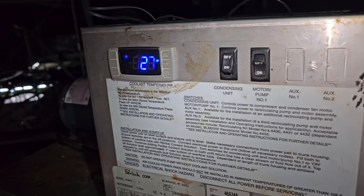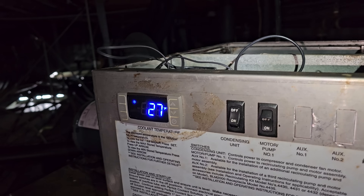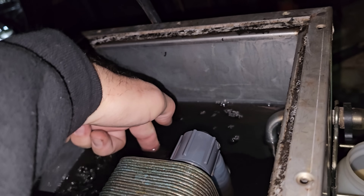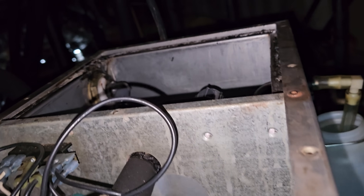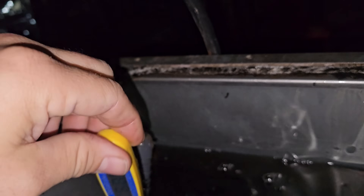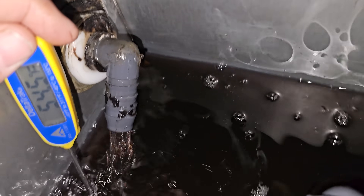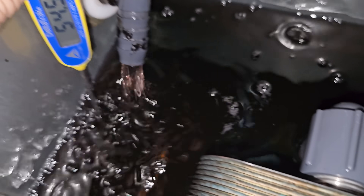The temp control says 27 and it's not rising, and I've had the compressor off for about 10 minutes — that should be rising. I pulled the reservoir off and it doesn't look frozen. I stuck my finger in there and it is not 27 degrees — it's more like 60 degrees. I put a thermometer in and it's sitting at 54 degrees. The glycol level looks a little low but not bad — not enough to have to really do anything.